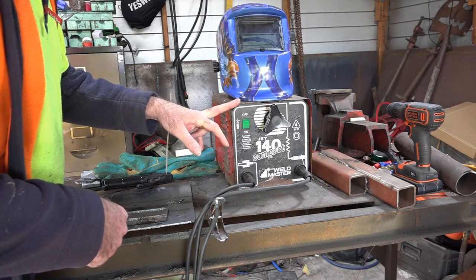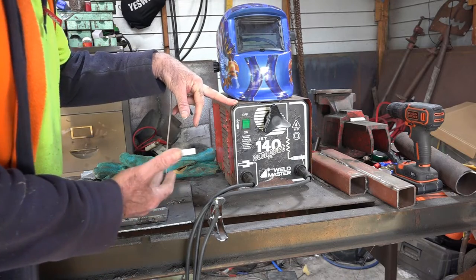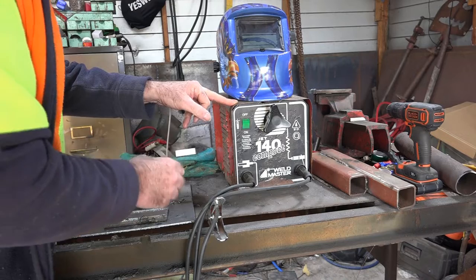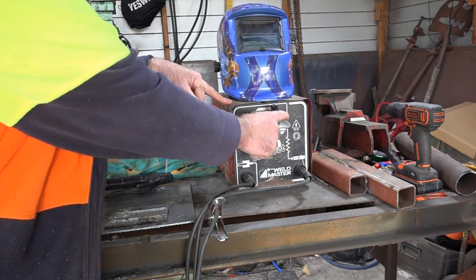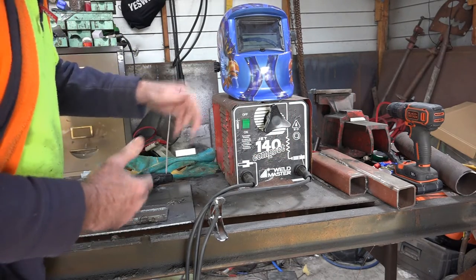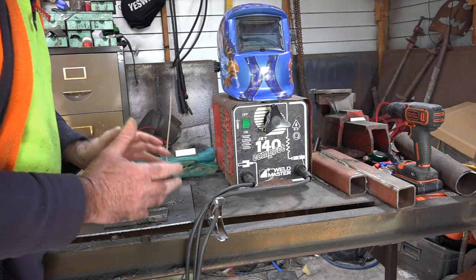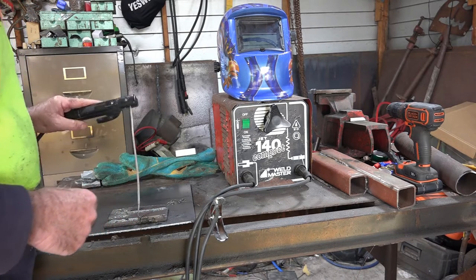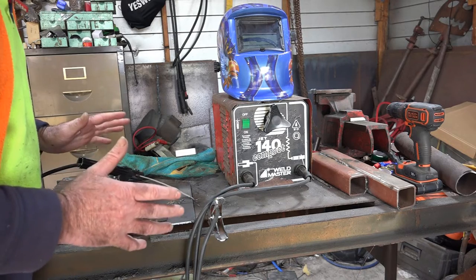So what I've found over the years, even using an old buzz box like this — you can pick these up for $20 or $30 if you want to start learning to weld. I get more trouble with my rods sticking when I'm using low amperage. Someone told me to crank the amps right up, so what I do is just crank them right up. You've got less chance of it sticking to your metal to start off with. That little tip helped me out a really, really lot, because I was trying to start the arc with lower amperage and it would just stick and stick. Anyway, that's the easiest thing to start off with.